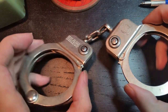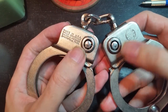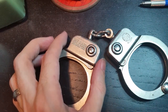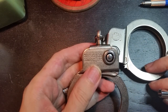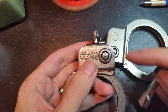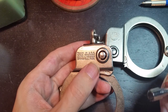For the most part they are not that different from other Smith & Wesson handcuffs of the period, but the big obvious difference is that key and the lack of any secondary double locking mechanism. The way this works is it uses a proprietary four-pin tubular core — a different diameter than pretty much everything else on the market. Instead of having an indexing notch that a protrusion on the key fits into, the key has a notch that fits over this blade, and that's what indexes the key.